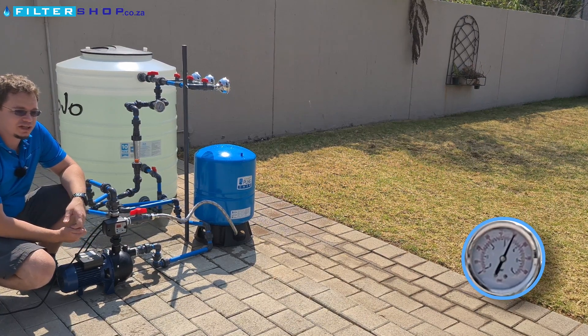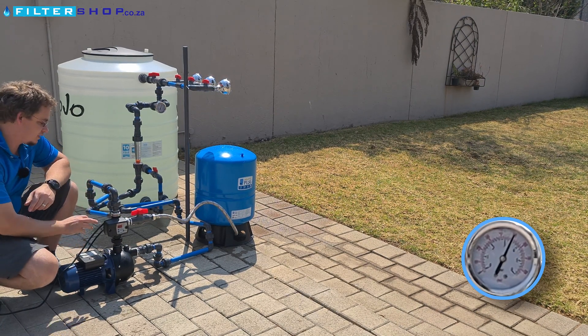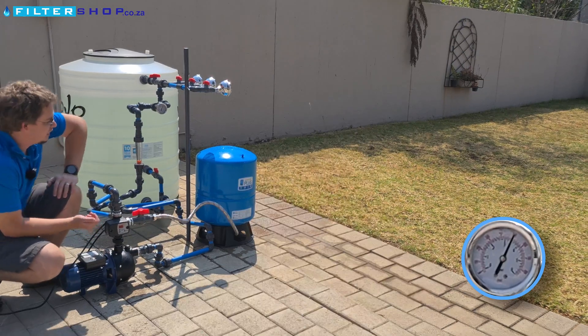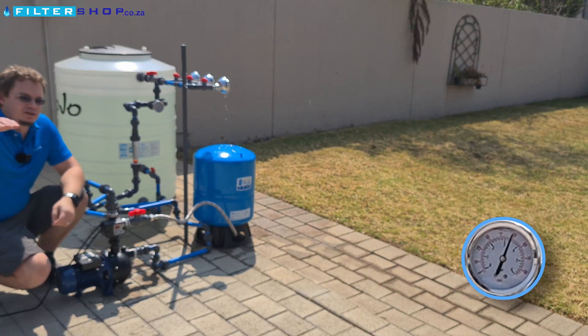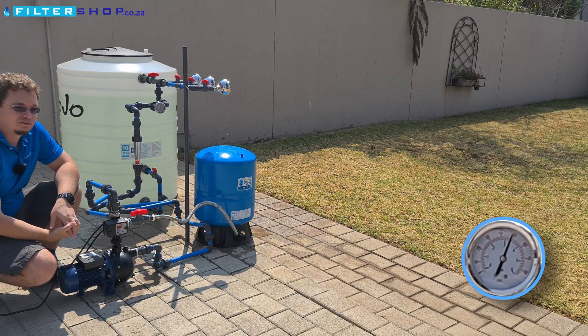The biggest advantage is that you get a massive reduction in power consumption, but you also get a smoother water delivery — if you open the shower, you don't need to wait for water to be there. It's just immediately there out of the pressurised buffer tank. So you haven't got the typical dip of flow and then pickup of flow which you normally have with these basic pumps.